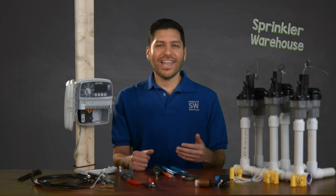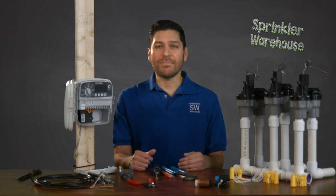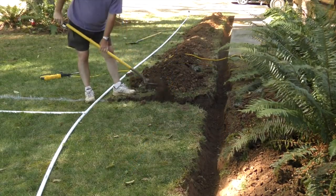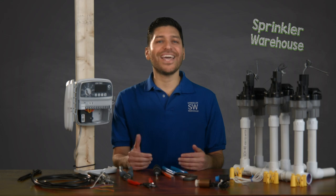A commonly asked question is: how deep do you bury sprinkler water pipes? You should bury the conduit at least six inches deep, or sometimes more if your municipal code requires them to be deeper. This will protect it from shovels and tillers.